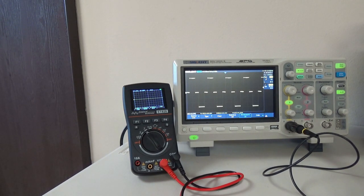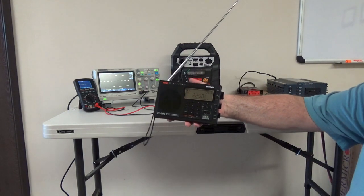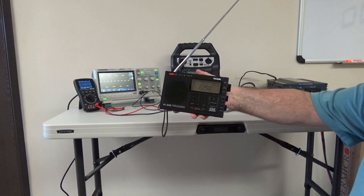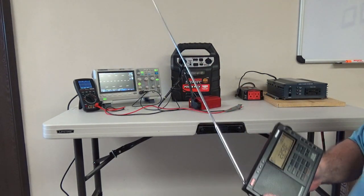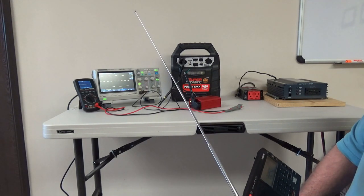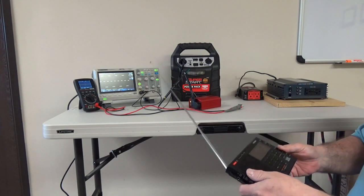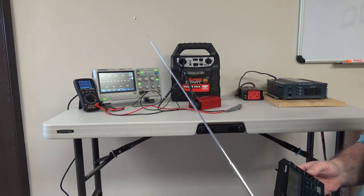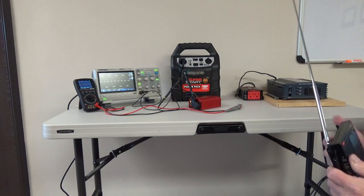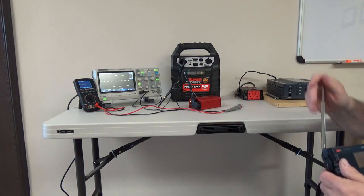While this is on, let's back off a little bit and see what the RF is. My little PL600 handles HF, MF, and LF as well as FM broadcast frequencies. I've got it down at roughly around 180 meters. That is a reasonably quiet device, but that square wave just isn't going to work for me. Let's go ahead and move to the mid-range inverter.